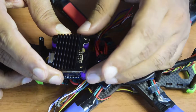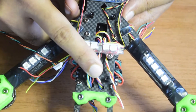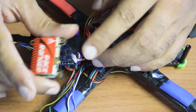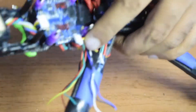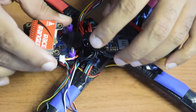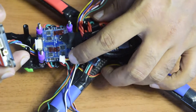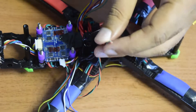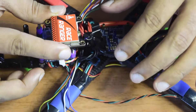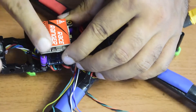There's also a video input and a smart audio pin to control the channel, which I'll connect to the microcontroller. Since I'm placing the DVR on the back side of the drone frame, I've already installed the jumper connection to supply 5V to the DVR and to pass the video output signal from the DVR as a video input to the video transmitter. So there are three wires going to the back for the DVR and three wires going to the front — two for power supply and one for smart audio to the microcontroller.